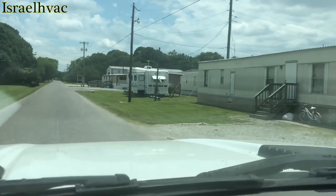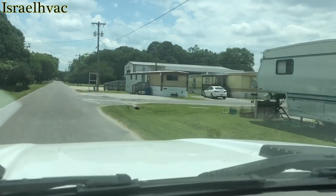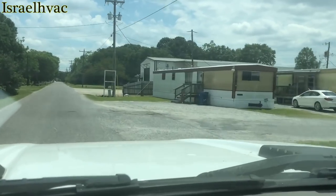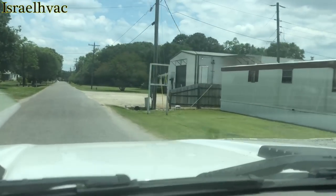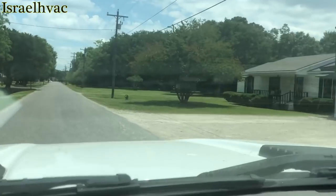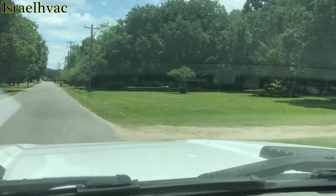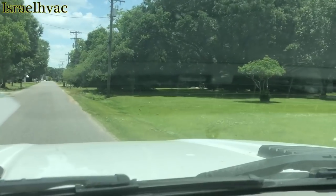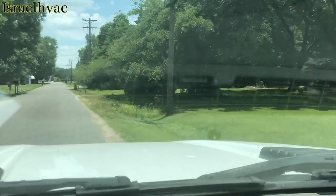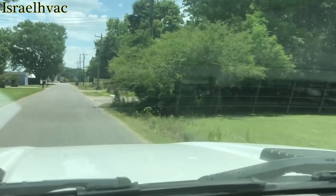And as far as the blower relay, I use that one because that's what we stock on the truck. We don't stock those sequencer type blower relays. That's the same one Goodman uses or used to use on their old air handlers. They have a time delay built in and they're just not very good. They're very notorious for failing. So I like that single pole normally open, single pole normally closed relay. They're really good. They last.